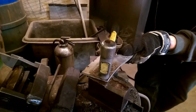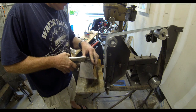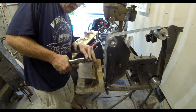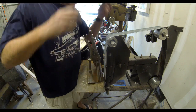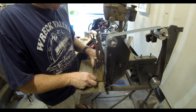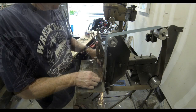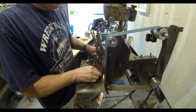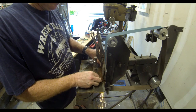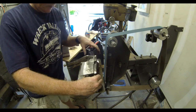Either way you're going to create these little dents on each side of the blade. The whole principle we're working towards is: we're going to create the peening or texture on the blade, then do the rough grinding, then send it out for heat treating, and hopefully the heat treating will give us that real dark look in each one of those dents created by the ball peen hammer. After the hammer peening is done, I basically just clamped the blade into my bevel jig — a piece of angle iron with a threaded hole for a bolt that sets the angle of the grind — and I'm going to do all the rough grinding before heat treating.